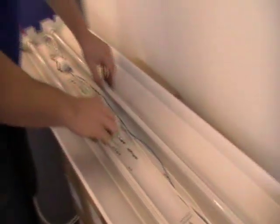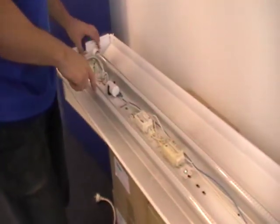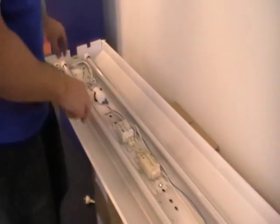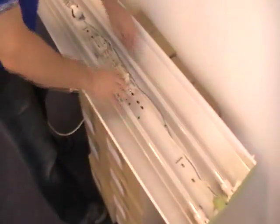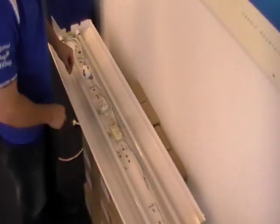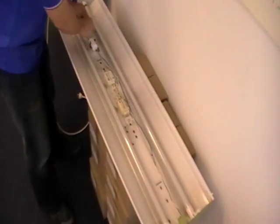This is how it looks when it comes out. You'll have two fluorescents and you'll have a starter at either end. We've removed the starters already. The way the fluorescents work and the way the LEDs work is quite different. So what we've got to do is get it so that the active is flowing down to the neutral. The first thing to do is we don't need the capacitor anymore.